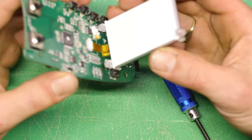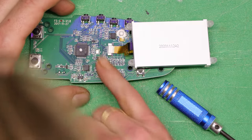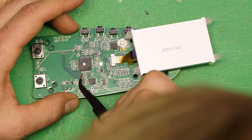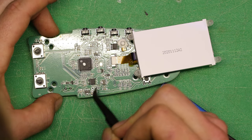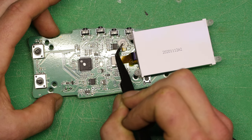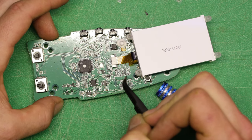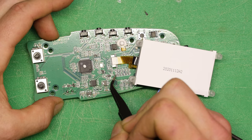Now, if we bring that up and over, you can see that there is a ribbon cable that connects that to the body of the motherboard, right there. And we have our ARM manufactured, ARM designed main processor. A little bit of white dot on it for some reason, signifying something. Looks like another choke, maybe a variable resistor, in hindsight, from the other analysis of the receivers, which is coming out after this. Sorry, that's going to hurt the brain. But as you can see, there is a lot of filtration hardware. Well, that looks unpopulated for the most part.